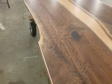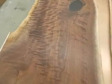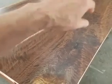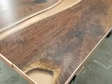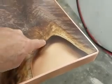Okay, so this is after, I guess, sanding with 800 grit with the natural Watco oil. It took about 30 minutes to do each side in 4 sections, and I'm also doing that epoxy, which should get clearer and clearer on the surface as I work my way up through the grits. You can kind of see that vertical wall in there where I had planed out the epoxy, the bad epoxy that bubbled so bad. Anyway, tomorrow I'll do 1,000 grit. More for the epoxy. I'll do the wood also.